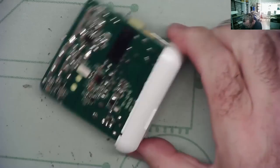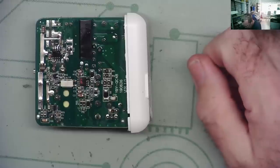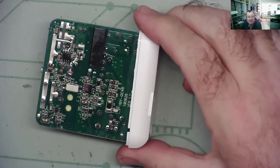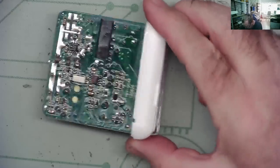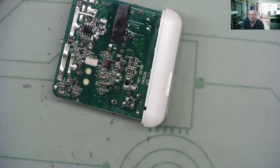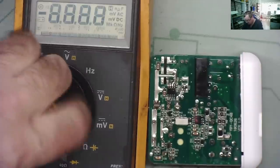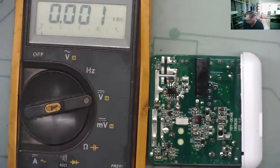What do we know about discharging capacitors? This hasn't been plugged in for at least 30 minutes, and that surprised me. It just went across one finger. I mean, it didn't do me any harm, but that surprised me a little bit. I better make sure there's no more voltage in it. That also tells me the power supply isn't starting, by the way, the fact it was holding the charge like so.